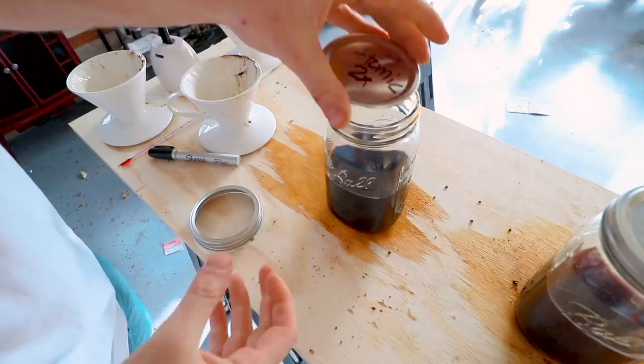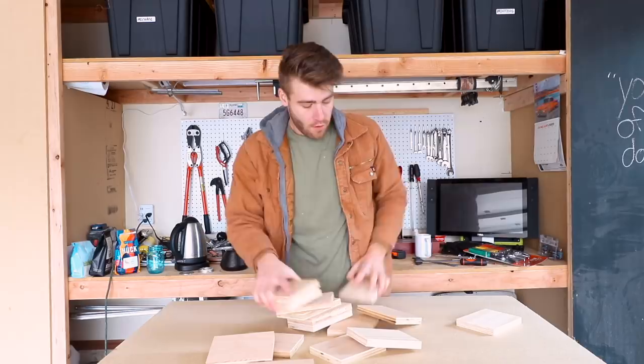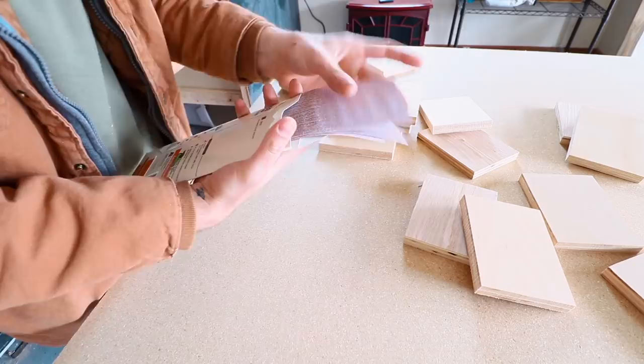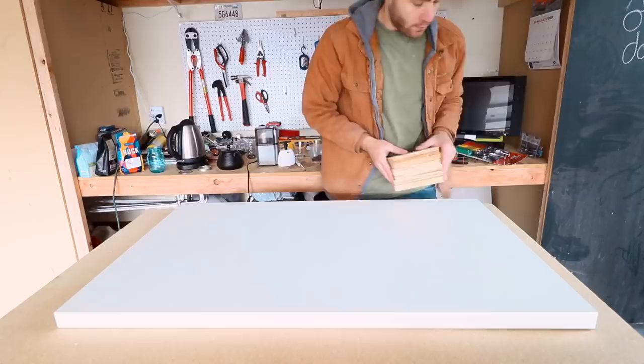For this test, I cut up a bunch of pieces of wood and sanded them with 150 grit sandpaper. I wanted to make sure the wood would soak in as much of this stain as possible, and that's why I didn't use 220 grit. From there, once I had all of my pieces sanded clean, I lined them all up and hot glued them down to my board.